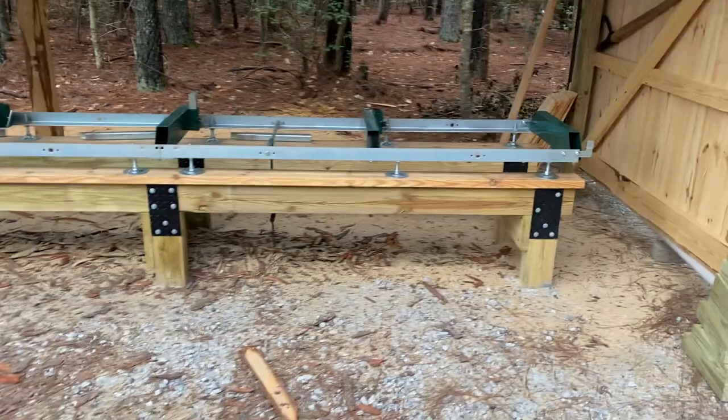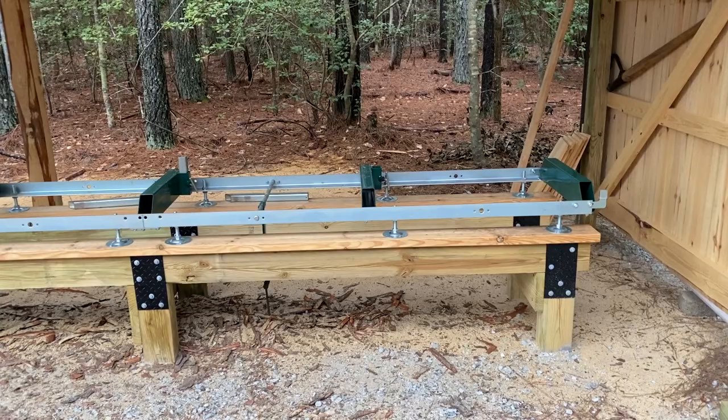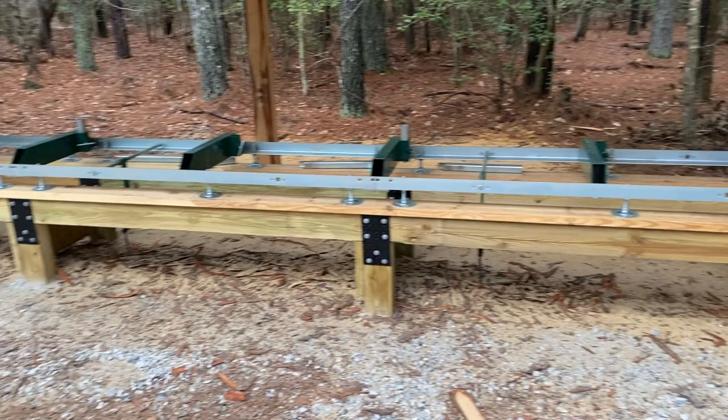The reason I elevated the sawmill track is all the past work I've done in sawmills have all been on trailer-mounted wood-misers. I found that the height of a wood-miser up on a trailer was very comfortable for working — it's a good height for offloading logs with forks on a tractor and lumber, and you don't have to bend over hardly at all.